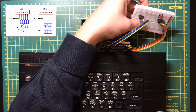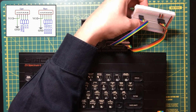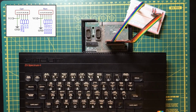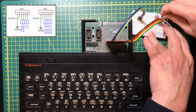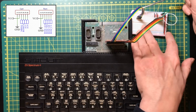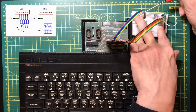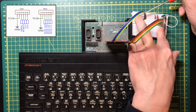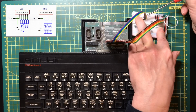And then we've got a couple of more complex ones. We've got the output enable and the chip select line. Those are ones we're going to have to do something more interesting with. But for now, let's just disable those. They're active low, so let's pull them high. So here we've got, well, we've not brought the power and ground lines across. We've got memory request, ROM chip select, and then address 15 and address 14. We can ignore the address lines.